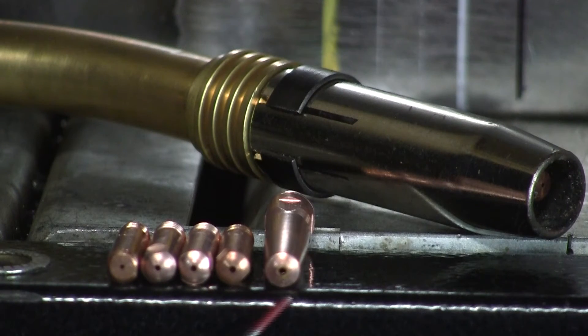Although the wires are very, very small, the efficiency and output of material is substantial. This is a 0.035 tip, and this is the very close equivalent of running a 1/8-inch stick welding electrode, or SMAW rod.